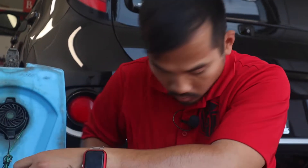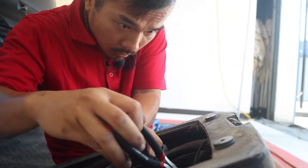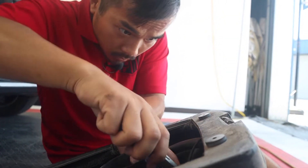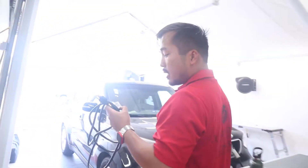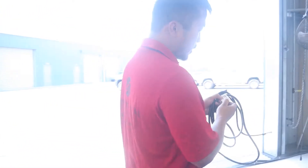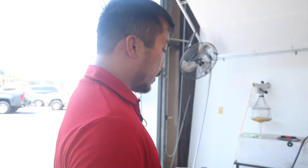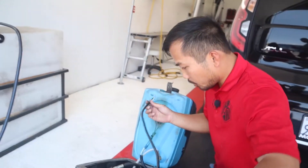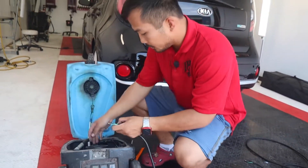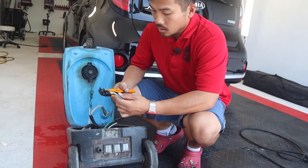This is the neutral — white is always neutral. When it comes to cords, make sure you get the right gauge. The higher the gauge number, the thinner the cord. This is 14 gauge — most 14-gauge cords have thicker wires, so they're for higher-powered machines. A 16-gauge usually has two prongs and is for things like a fan or a light. Use 14 minimum; I'd prefer a 12 because this machine requires a lot of power. All I've got to do is splice and mend these together.